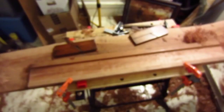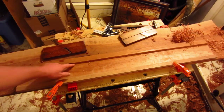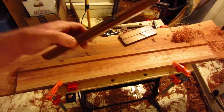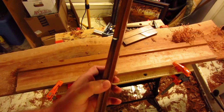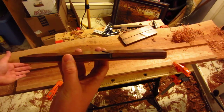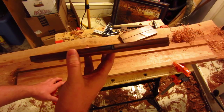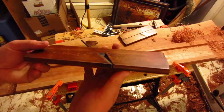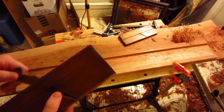Now the idea is to recreate that on the opposing side. And because it's a skew plane it's not a problem going both directions. This one is only very slightly skewed — almost nearly head on — so I'm a little worried about it. I may have to flip this one over, but that's the benefit of starting off with really fine shavings high up on the corner: if you get a little tearout you'll have time to recover and figure out which way the grain is going. I would prefer to have a skew hollow set, but I don't have all skews yet.